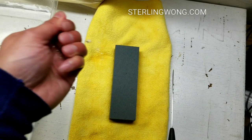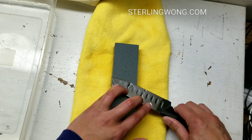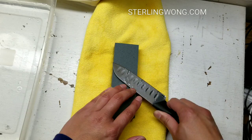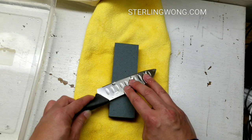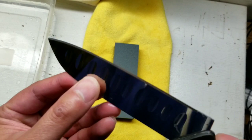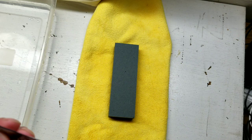I used the coarse side first, then started using the fine side. As you can see, it's holding more water now as I work with this. So this is like 20 minutes in and I'm just nicely, slowly putting one edge all the way to the tip and sharpening it. I use the water on my fingers to guide down the blade so that it lubricates as I go through — I found that's an easier way to keep it lubricated. I usually start splashing more water onto it and basically working the edge so it's nice and even on both sides, starting from the tip all the way to the back.